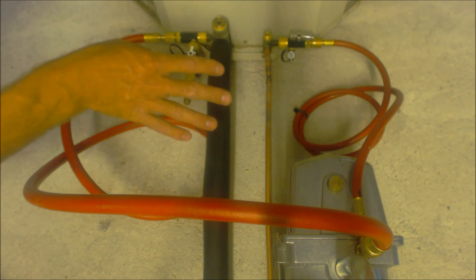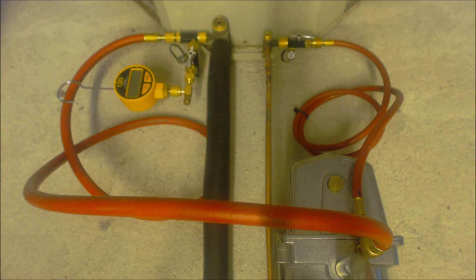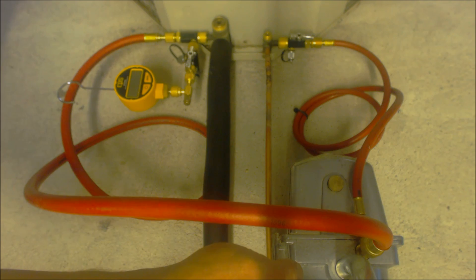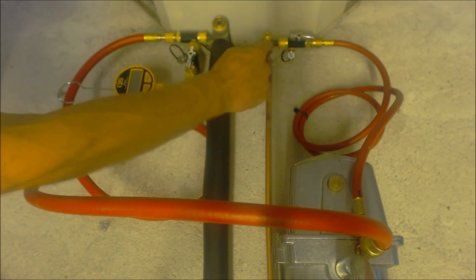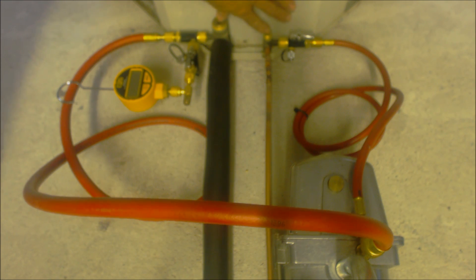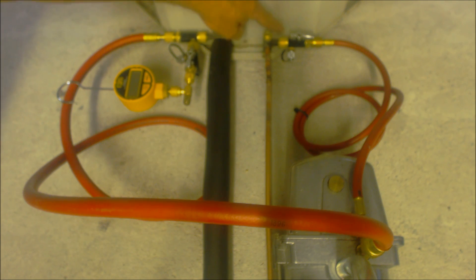With this method, you don't have to have your refrigerant manifold set — that just ends up adding possible other leaking points. So we're just using this two-hose setup. Once we reach the required vacuum level, we're going to turn the valve off here and the valve off here, shut the vacuum pump down, then read our micron level. Make sure that it does not rise above 500 microns. After it does not rise past 500 microns, we're going to valve our micron gauge off, then add our liquid refrigerant into the liquid side, with these valves off. The reason we're not breaking the vacuum by opening up the service valves is that these service valves are already open — they're already back seated all the way up. This would replicate some type of replacement inside the outdoor unit, such as the compressor. That's why we're breaking the vacuum with liquid refrigerant into the liquid line.